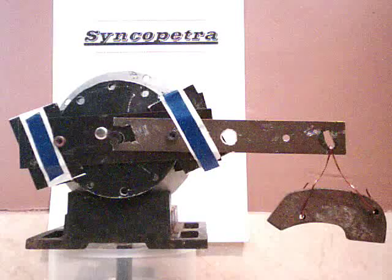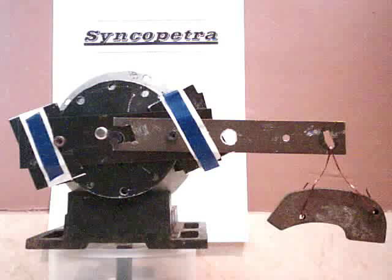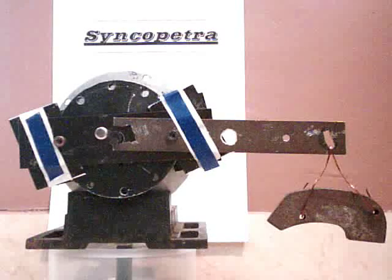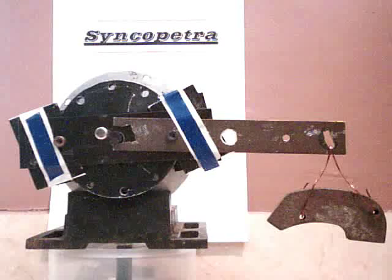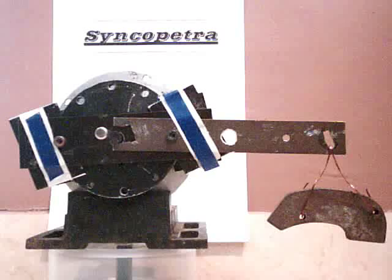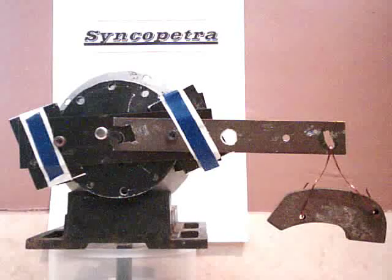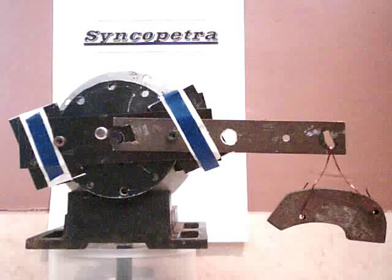The torque data teaches us what is required to make a practical motor. 0.6 newton meters of torque is generated with magnets having 5.6 square centimeters of engagement. A 1 kW motor produces about 3 newton meters of torque, so we are 20% of the way there. This package can support 8 times the number of magnets, so it has the potential to produce more than 1 kW.